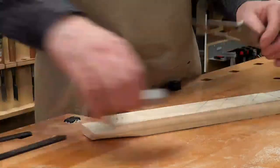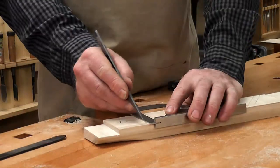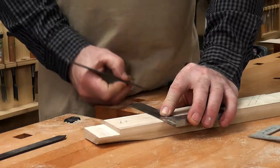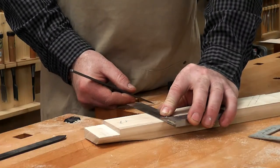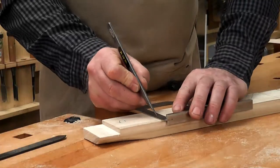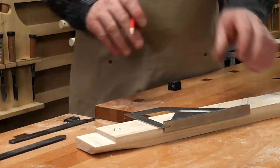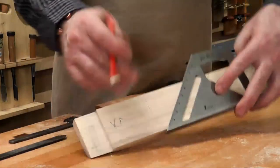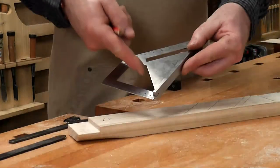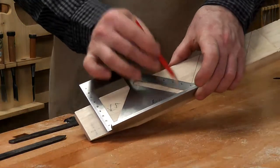It's that side. Yeah, you can do that with a square. I've got more material to hold here, so actually it draws my thumb away from the cut point. If I'm using a normal square and I'm clamping on, my fingertip gets a little bit near to where the knife's going to be, and occasionally I put a little flat spot. It's not the best thing to do. This being wider, got more room to get on. Easy to do. This one also has things. Obviously, you have 45, new angle, works right or left hand because it's over. You have angles inside 45 again, and they come right down to where the bottom bit is, that lip.